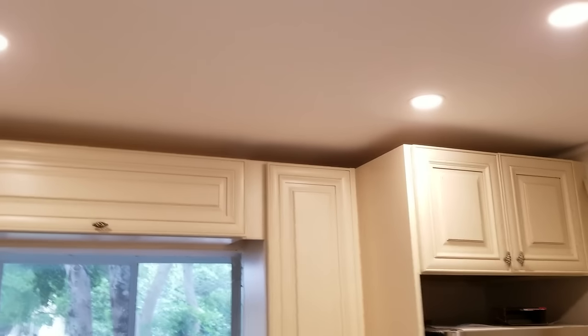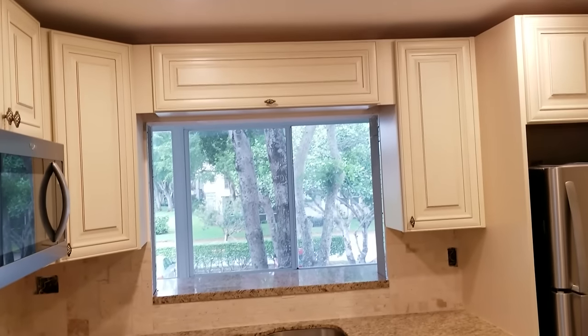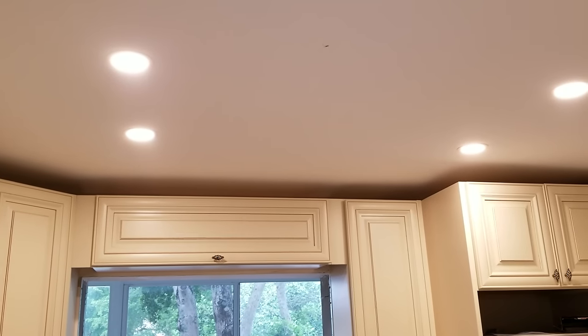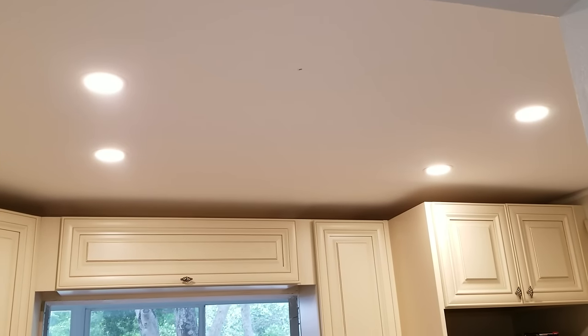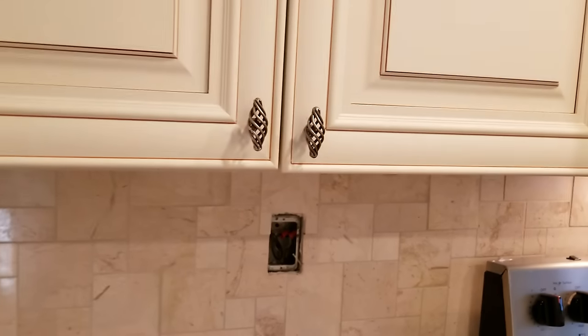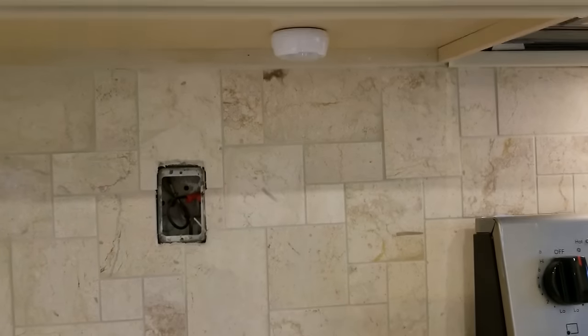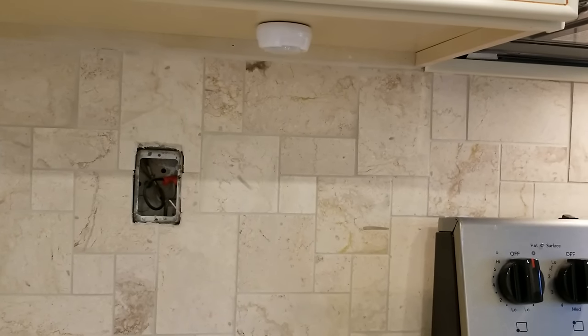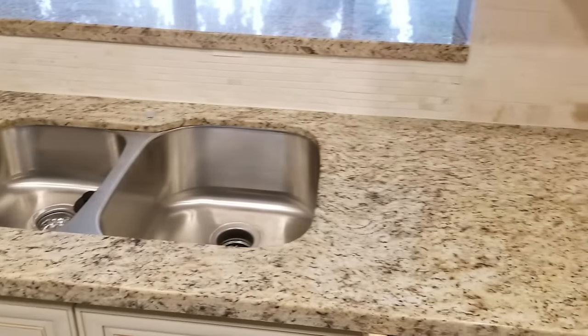I made it symmetrical on this kitchen — 36 inches off that wall, 36 inches there, and 36 inches to that wall. We did this small 8-by-10 kitchen with just four lights, and it lights up the kitchen very nicely and evenly. This is why it is so important to design your lighting ahead of time and think about it very carefully. Some people do under-cabinet lighting — I'm not a fan of wired pucks; I like to use these small remote-controlled LEDs. They may not always be as bright as the big plug-in ones, but they'll put some light down there if you ever really need it. In this case, we don't really need any under-counter lighting here.